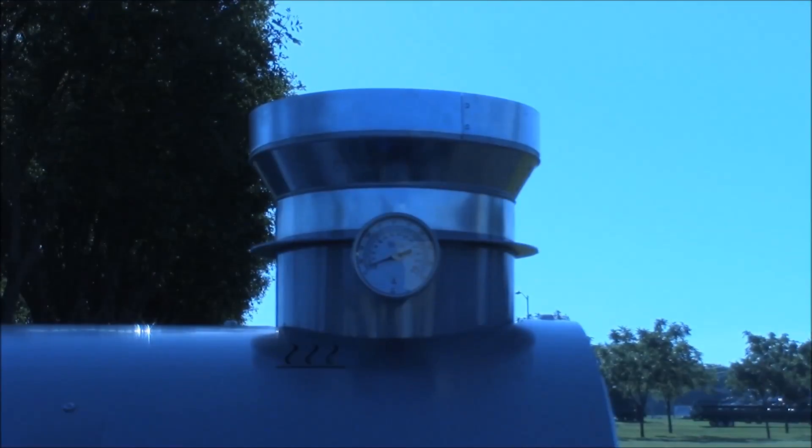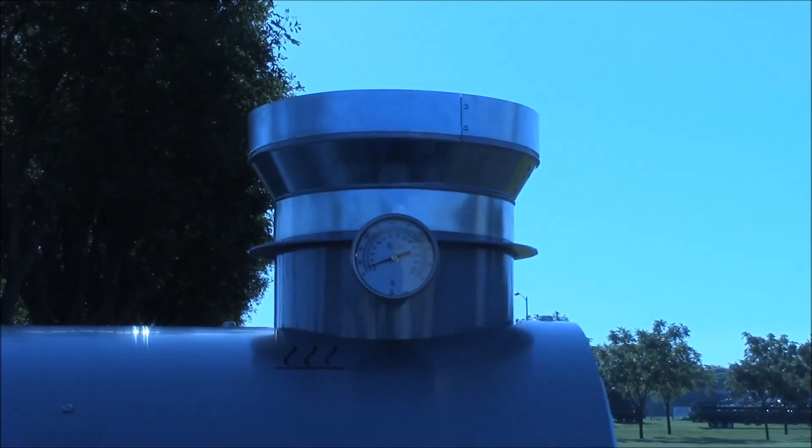The HM1.7 has a 12 inch diameter exhaust stack connection at the top of the heat exchanger, and any ductwork connecting to the machine should be at least this size. It is recommended that a qualified HVAC contractor install this connection.